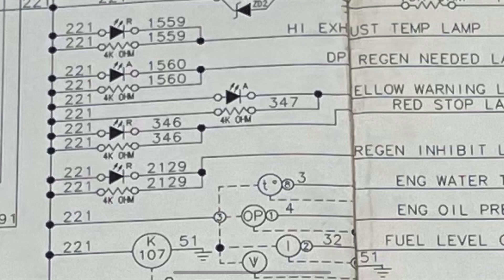So what's the deal with this resistor? Why is it teed in on the positive side and on the negative side of this LED? Let's paint a hypothetical: what happens when you put a wire across the terminals of a battery? In a perfect world, you get infinite current, which melts the wire — we call this a short circuit. Because diodes are designed to have minimal forward resistance, we get the same effect as a short. You put a resistor in the circuit to provide something to resist against current, limiting it down from infinity. Without this kind of buffer, you can't expect a very long life from these LED lights.